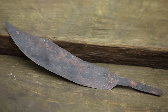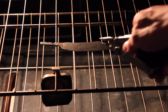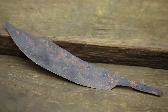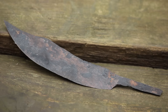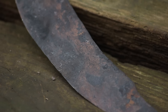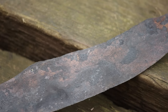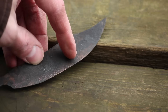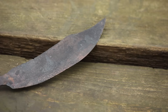Here's what the knife looks like after I tempered it. I just set the oven at 400 degrees, let the knife heat up in there, left it in there for about an hour. Took it out, let it cool down, and then repeated that three times. It's what's called the triple temper, and you can see that the blade has got sort of a brown patina to it — you can see through the black of the quench, but on the actual steel itself you can see it's kind of got a brown patina to it.